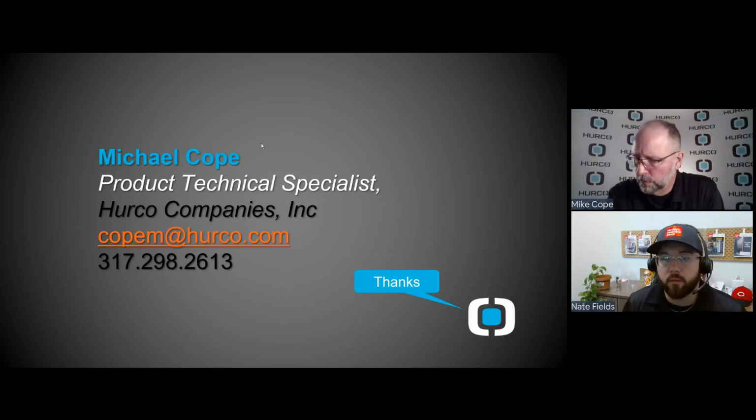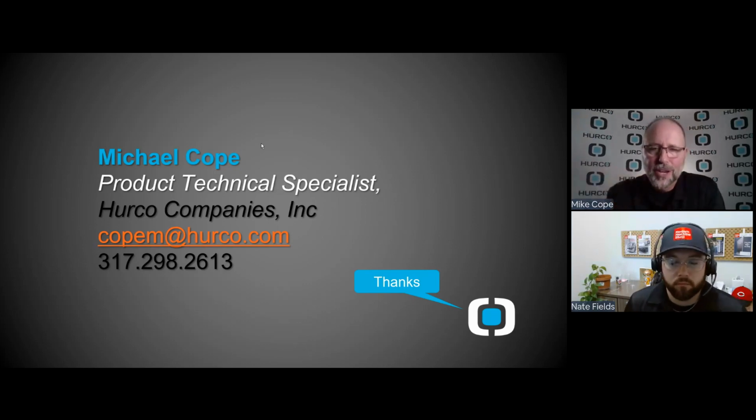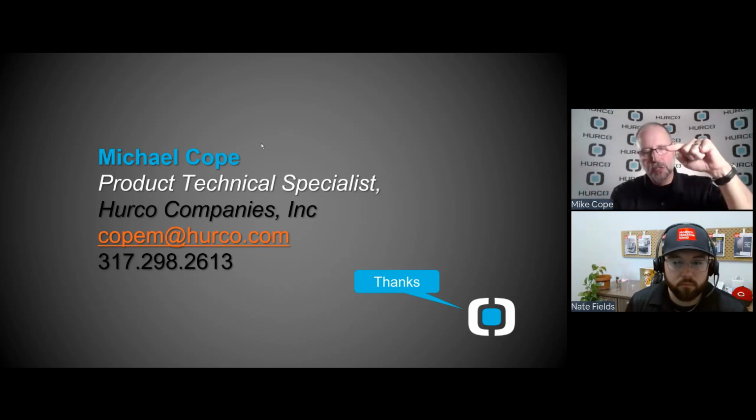Got it. And next one says, what's the difference in rigidity between the trunnion and swivel head? Well, the tilting axis is going to be the weak point in either. Neither one of them are light duty by any means. And I would say, depending on how hard you push it, you could affect that rigidity on either one of those. On a swivel head, you've got 9.5, 10 inches to the face of the spindle, and then you have whatever length of tool you have hanging out of there. So you've got a pretty large fulcrum if you were trying to overtax it.